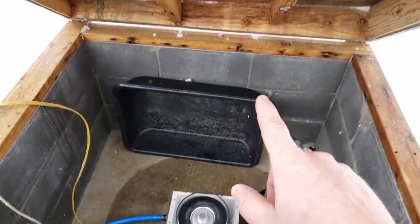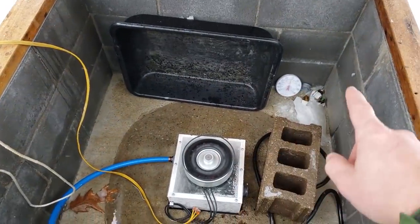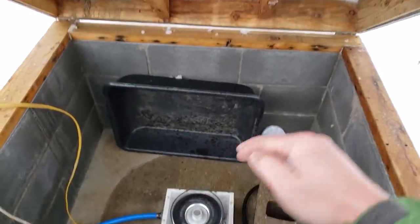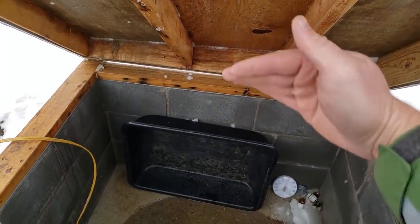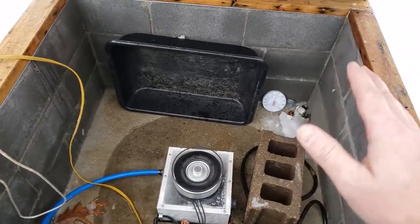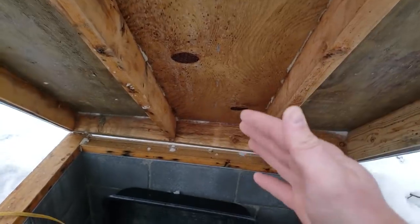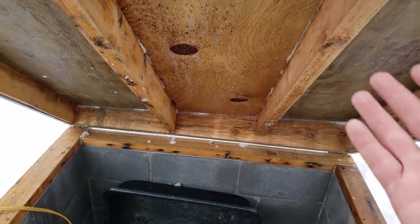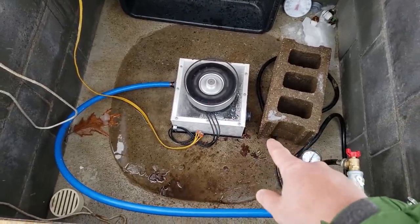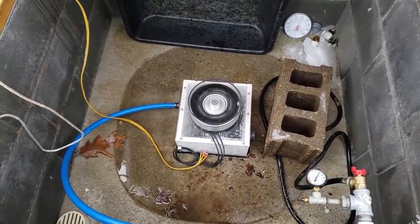Now that it's not flinging water it won't have as much moisture, but I still need to put in vents. I'm thinking about doing a second lid — a perimeter of foam on the walls and then a foam lid underneath this one, on a separate hinge. The foam won't rot or corrode, and the outer lid just protects from rain. I'll put vents in so all the wood can dry out properly, and maybe some ducting from the fan — not sure yet.